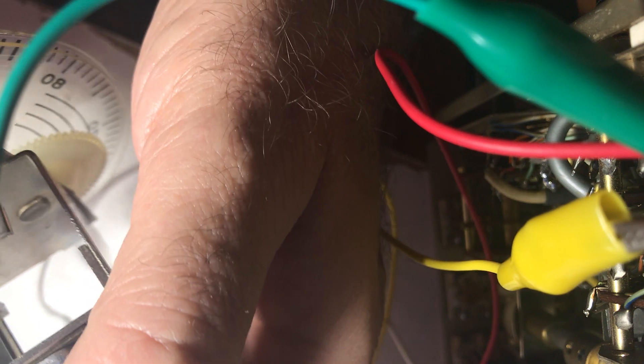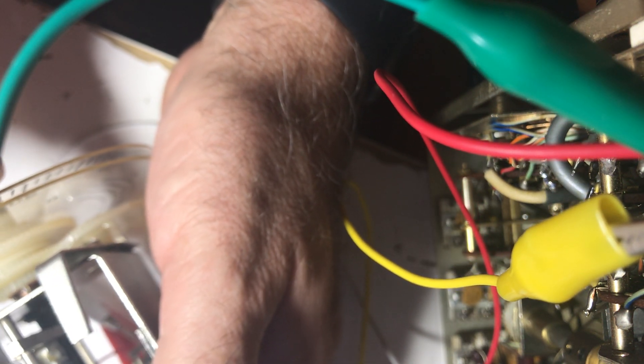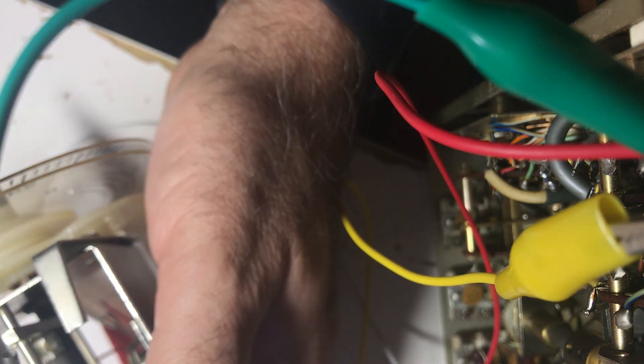Hopefully the pin isn't too far from the stop - it is pretty close. So I don't have much leeway for mistakes here. You might want to take the gear off and move it a tooth or so. I don't like being on the pin - that doesn't give us room for future errors. It's running a bit high so I'm going to take it down one notch.